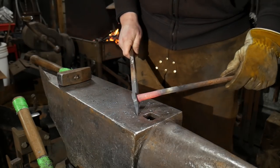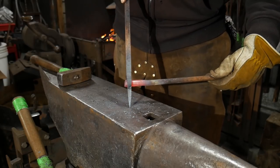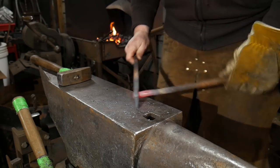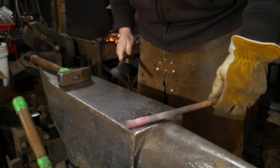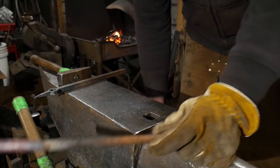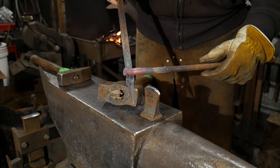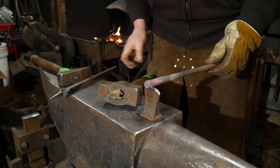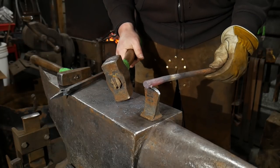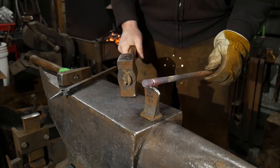The next thing is we need to cut it off just a hair over — and I do mean just a hair, a smidgen. We don't want a lot of material hanging out both sides that we have to blend back in, so don't get carried away with this portion. We're going to take this half-inch material, or 12.5 mil, and go to about 5/8 on the length of this little slug we're about to cut off.